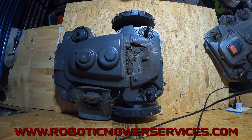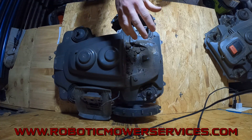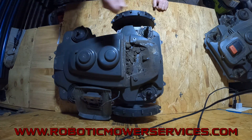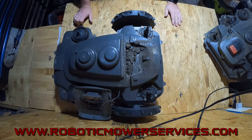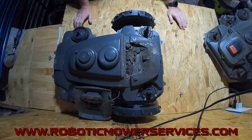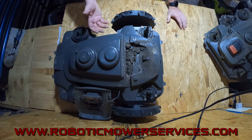Now that you're aware of that, make sure you look into it and take care of it. If you're a dealer, don't skip over that — definitely take care of that on E-Post mowers. You want to check that a couple of times a year. Honestly, every time you're changing the blades, just pop that cover off — three screws — take it right off and blow it out. Make sure it's nice and clean. If you see it's getting to look like that, just replace it. For a couple of bucks to replace that filter, even a couple of times a season, it's still way cheaper than labor and main boards and wheel motors and whatever else might burn up in the heat because the heat can't get out of the machine.